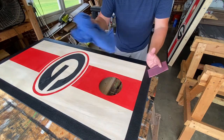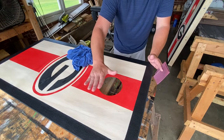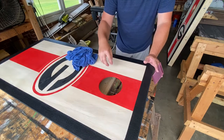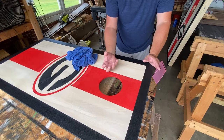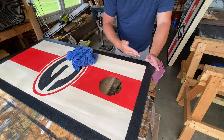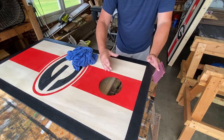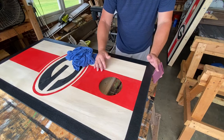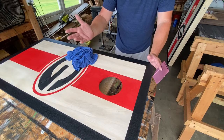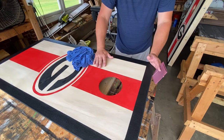I'll do this over the whole board — the colors first, then the bare wood — and I'm cleaning as I go. We don't want to let the humidity get to that paint residue or it's going to want to adhere to the wood again. Get that stuff off quickly: small patches, get it off, small patch, get it off. And with that, that's it. It's pretty easy, but I'm going to let you watch me do the whole thing — it doesn't take long, and you can see how we do it from A to Z.